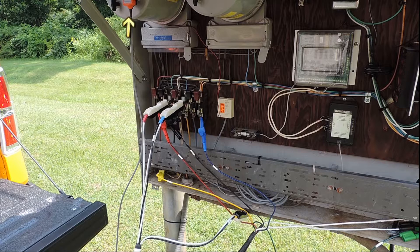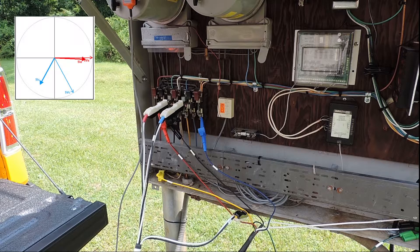Verify that your infrared detector is connected, and pull up your vector diagram and verify your vector looks correct for the installation you are to use. If you have any doubts, you can select the reference button and verify that it looks like the reference.